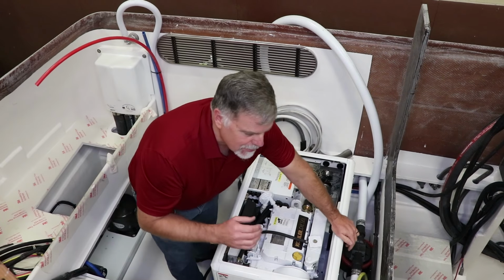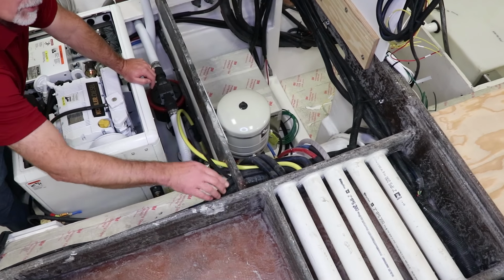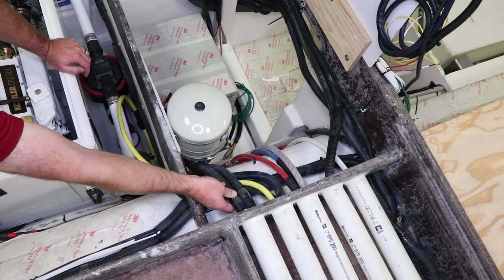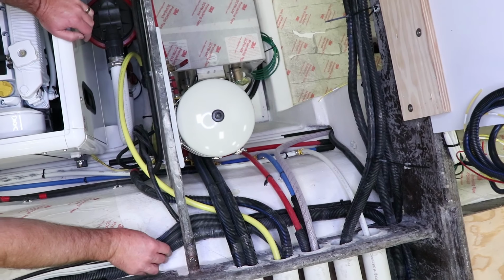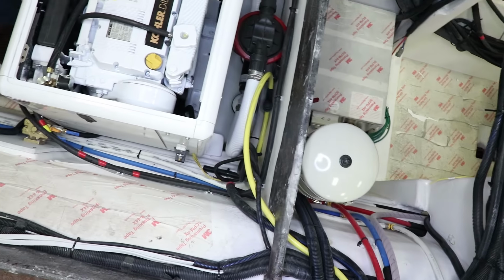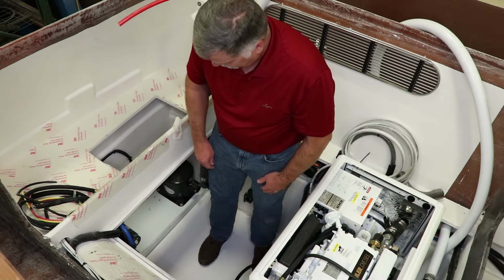You can see some of these PVC tubes here where we have cables and things running through. They're actually cut through the bulkheads, laminated in place. The edges have been deburred. The cables are running inside a conduit, and chafe protected throughout. So, really nicely done. I'm standing again on a nice fiberglass floor that's flat. I hate standing on uneven surfaces when I'm in a space.